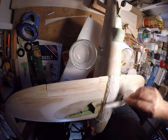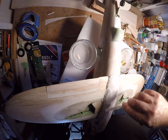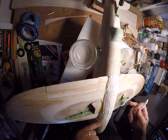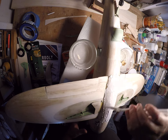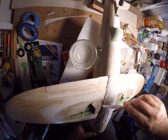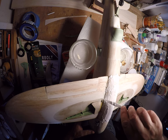There are some areas here where the way the parts went on — and the fact that I might have gotten this rear former over to one side a little bit too far — means I'm going to have to fill out this bubble on this side. I'll have to do that a little bit creatively with the filler, more than I would have liked with just the parts handling all that shaping for me. I'm going to have to do a little extra shaping with this stuff.